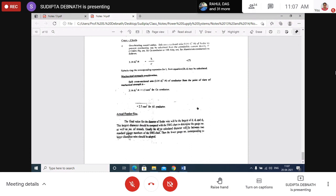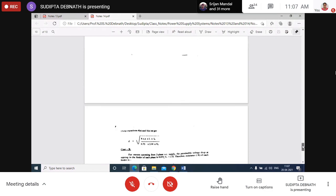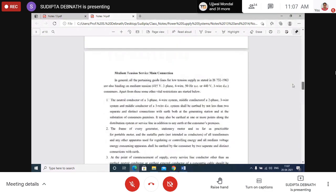The calculated diameter must then be compared with the Standard Wire Gauge (SWG) chart to find commercially available sizes. The calculated value will usually fall between two standard gauge numbers, so the lower gauge number — corresponding to the larger diameter — should be adopted. This gives the final feeder wire size.